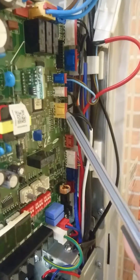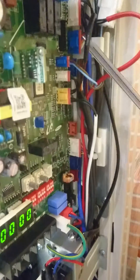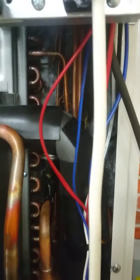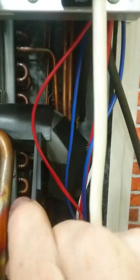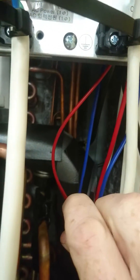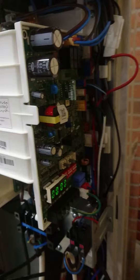The two water sensors are here on this yellow plug. The black sensor here, if we follow all the way down through the harness, you can see it comes into the return water pipe here. You can see it tucked into the insulation here. If this gets to above 70 degrees C, the fault code will show as E901.